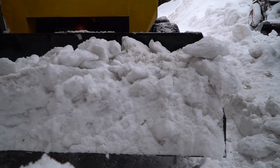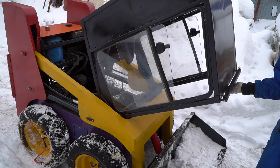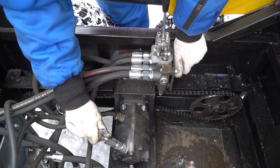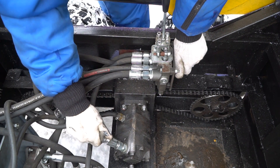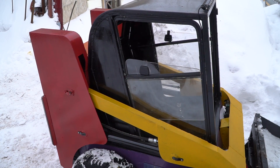It took a while for the skid steer to start biting into the snow and remove the heavily packed portion. After a brief stint I heard a crunch coming from the left side in the area of the hydraulic motor. It turned out the motor attachment bolts had become unscrewed from vibration and load, and the chain began striking on the teeth — that caused the crunch. I tightened the bolts of the hydraulic motor and continued my work.